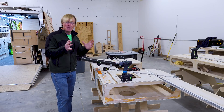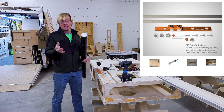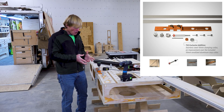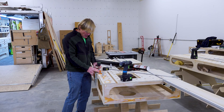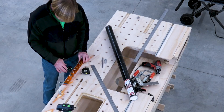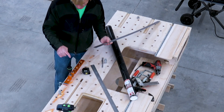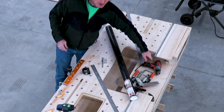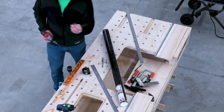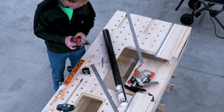If you do, that's great, but if you want to do it yourself there's a way to make it CNC quality, and that is with this PARF guide from UJK. Here in the US, one of their suppliers TSO saw that I was going to do this and said they wanted me to try out this tool - a simple jig that allows me to drill 20 millimeter holes with a Forstner bit, which is included. Pins drop into holes that you pre-drill using the two rulers they send you, and they also provide a guide so that you can drill a perfectly straight up-and-down hole as if you had a drill press.